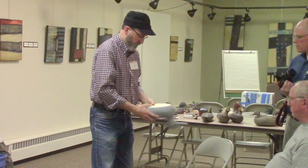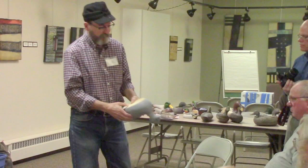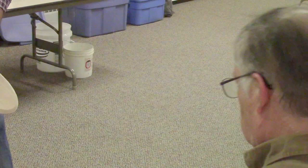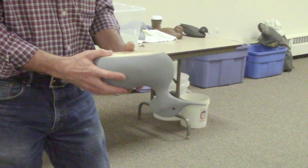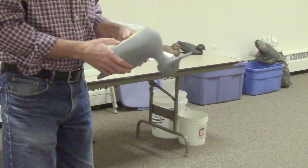You can use five-minute epoxy on something like this, but then you've got to work really quick — within five minutes. I heard somewhere that the longer-curing epoxy gets more waterproof as the time goes on, so a 20-minute or 30-minute would be more waterproof than five-minute — more than likely. I would usually use the stuff that sets up in a day — that's West System. Certain things I use five-minute, and certain things I use 10 or 20 minutes, whatever I need time to play with.